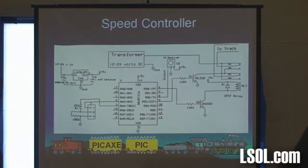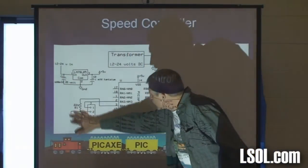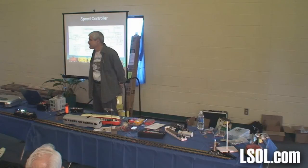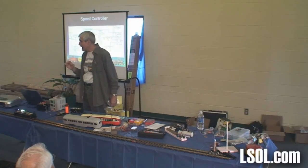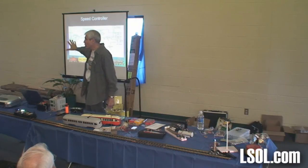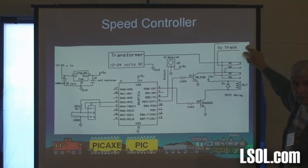The last schematic adds two more parts. Here's that voltage regulator — it takes the power from 18 volts or whatever you're feeding to the train and gives you five volts to make all these devices happy. And this is the part that connects to the computer so you can program it. You have to pick it up from the transformer or power supply because a voltage regulator requires plus on one wire and minus on another — if you switch them, you'll blow it up. This is a trackside controller: your transformer supplies a constant 12 to 24 volts DC, this whole unit controls it, and this goes to the track. This is not in a train.